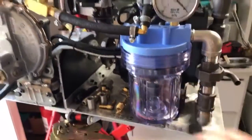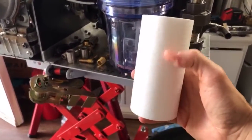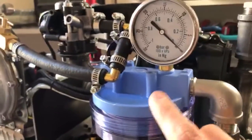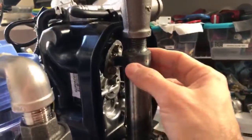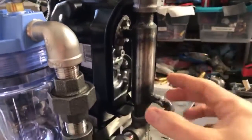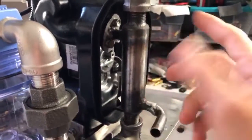That goes into here. It's going to pick up water through wick evaporation. I put a little water in the bottom. It's going to wet this whole thing, and then the air will move through from outside to inside, so it'll be moist air. So it'll be air, fuel, which is propane, and water all going into here, up the middle pipe, with exhaust coming out the outer pipe right here. These are just two pipes. This part right here is a half-inch pipe going straight through here, and then I slid a larger pipe over the outside of that with very little space between the two pipes. See my other video if you want to see that.